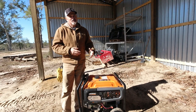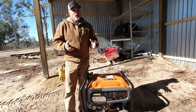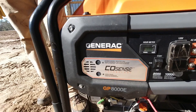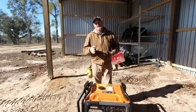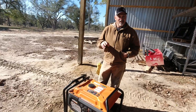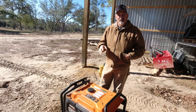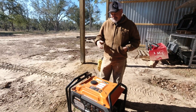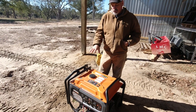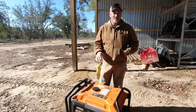I've been really, really pleased with this Generac GP-8000E. If you're looking for a generator to provide power after a storm or inclement weather, I recommend Generac. We've used this thing over 200 hours and it's really been good for us. I keep it full of non-ethanol fuel and run it about once a month so the engine stays fresh — you don't want a dead battery or clogged fuel lines the day you need it. Do some type of preventative, scheduled maintenance to make sure it's in good operating condition when you need it.